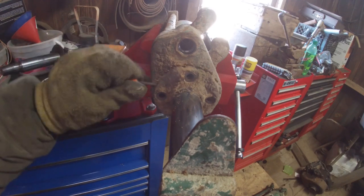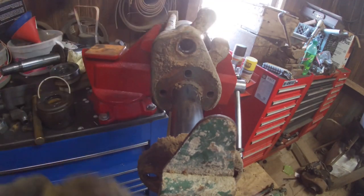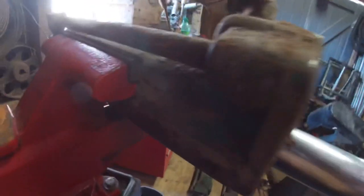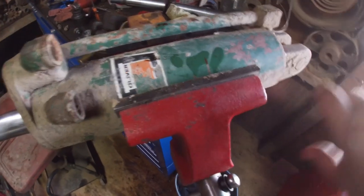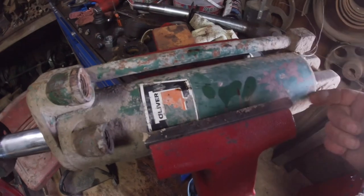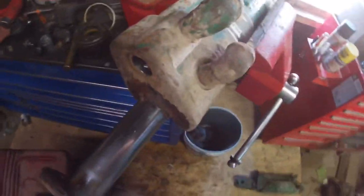This is just a little metal retainer plate — we'll just slide that forward. But this piece is a cast iron piece, it's got three bolt holes and it's open on one end. It basically holds the head end that has that plunger in it, and then it also seals to this tube. If you look at these cylinders, the way they work — you have two elbows from your two remote hoses. This one goes into the head end of the cylinder, so it's what forces the oil this way and retracts the cylinder. This one, which is attached to the piece we're about to take off, sends the oil down this long tube to the bottom, to the backside of the piston, and it's what sends the piston out. So we have to take this cast piece off — it's just got an O-ring on the end of this pipe and we'll replace that when we go back together.